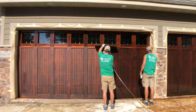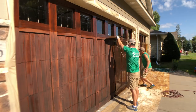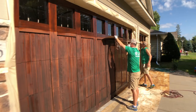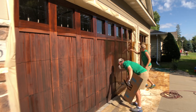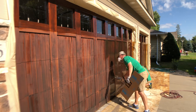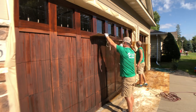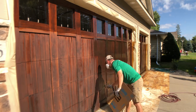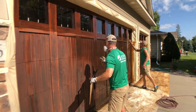You can see Mitch following right behind me with the back brush. I'm spraying on a fairly heavy coat so there's plenty of material to work with. You want to go end to end, grain to the wood. Since this door is paneled, there are cracks between each panel — check those to make sure there are no drips coming out. We'll eventually raise these doors so they can dry flat and out of the elements, but check them for about 10 minutes to make sure you won't have any drips.